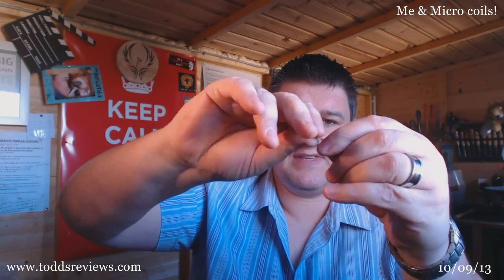And I've also done a quick video on twisted coils, taking two bits of wire and basically halving it and twisting it together. So effectively, with that wire twisted, you're getting half the resistance almost. Well, I'm kind of guessing that micro coils are much the same. Basically, just say you take 10 wraps of a really thick gauge wire. Now when you do the 10 wraps, and this is just 10 wraps as an example, let's just say those 10 wraps would normally come out to 3 ohms.